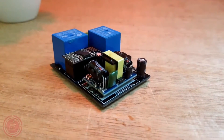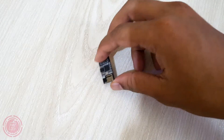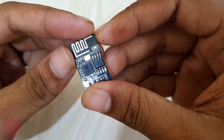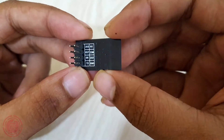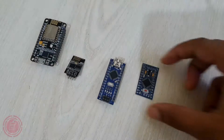About a month ago I created a wireless two-channel switch using this module. This module uses an L106 32-bit RISC microprocessor core based on the Tensilica Xtensa Diamond Standard 106 Micro running at 80 MHz, and it has a flash memory of 1 megabyte.